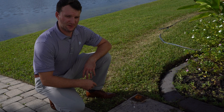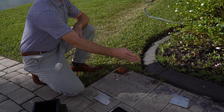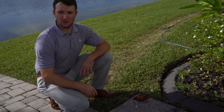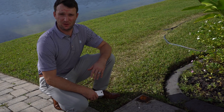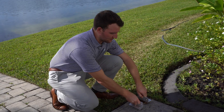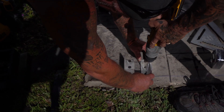There was an existing pergola here, so we have a metal plate to grind off. Once we have a clean surface, we pull a line from the back house wall — the projection is 8 feet — and find the center of 8 feet, because these structures are measured center of post to center of post. We then reference the WD connection details on the portal and lay out the internal clips so the post slides right over the top. These internal clips have three holes and use a through-bolt connection for a strong, sturdy attachment.